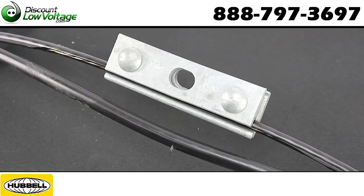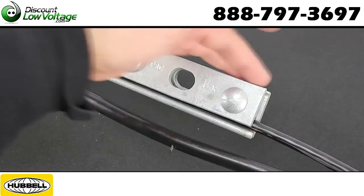In their spec sheet it mentions quarter of an inch messenger wire. It is quarter of an inch, but with the coating around the messenger — to help endure that messenger cable for years and years — it's a little bit bigger. So you're probably going to want to put it on this bottom slot here and add some lock washers behind there.